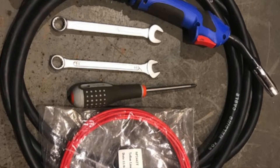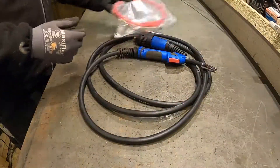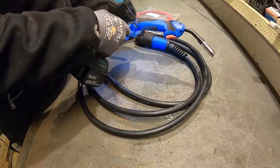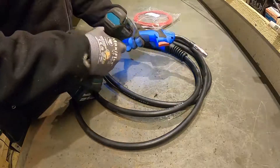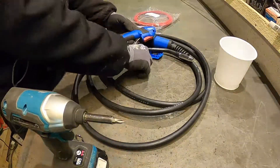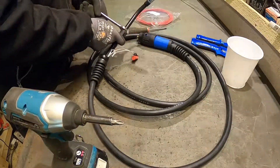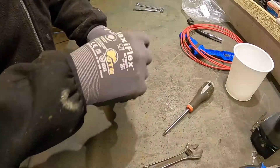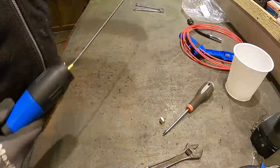So I decided to replace the wire liner with one made of Teflon. I bought this one on eBay from a seller in the UK. It's a very simple operation. I start by dismantling the MIG gun. Maybe this isn't always necessary, but it can be a little troublesome to get the new wire liner through the fitting in the end of the hose if it's still inside the handle. I put out the hose as straight as possible on the floor and unscrew the lock nut, then simply pull out the old liner.